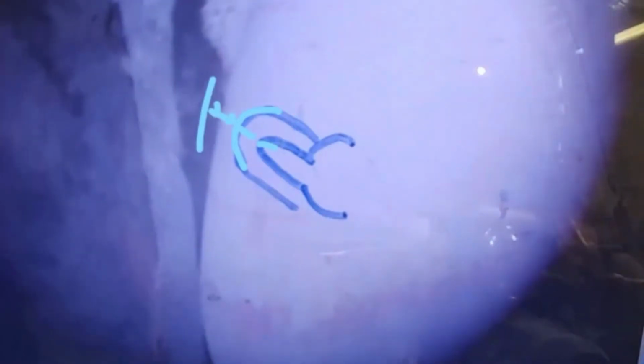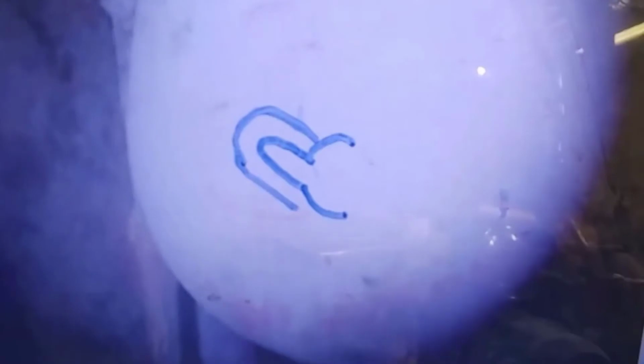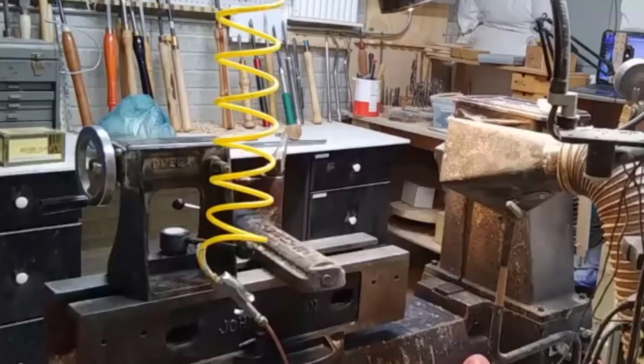So you can see here, the wall thickness is roughly 1/2 inch. I gotta get rid of a little bit more. So this one is not quite done yet. You see here, I'm a little bit thinner. I only need to remove maybe 1/8 inch or so. And at the top, I left it relatively thick yet. And that was a little bit intentional, that I was thinking of doing some carving on this one, and I thought I might want a thicker wall for that reason.